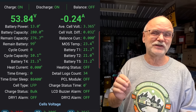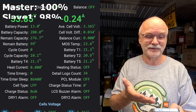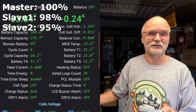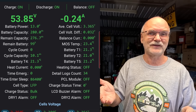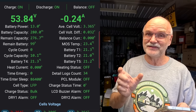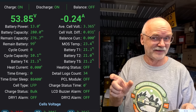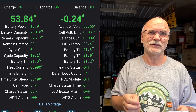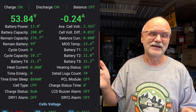This is where a lot of confusion comes from for users. You set this in your master BMS and think you've hit 100%, but all your other slave BMSs haven't reset to 100% yet. Why not? Because maybe you have different settings in your slave BMSs — a different timer, a different RCV voltage, a different state of charge 100% voltage. Each slave BMS needs to be triggered with those specific settings. In the last firmware, Jikong decided to show the BMS status and timers for all BMSs, regardless if master or slave.